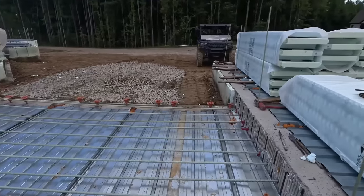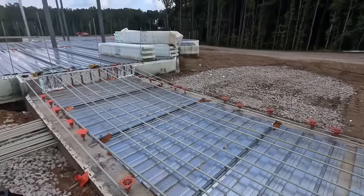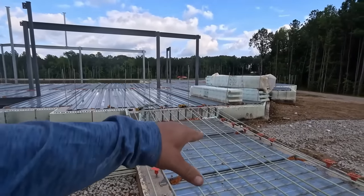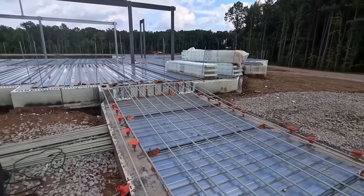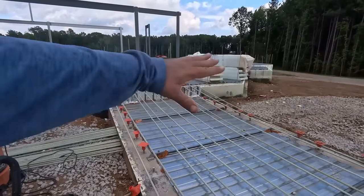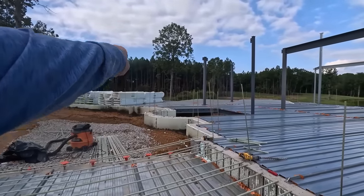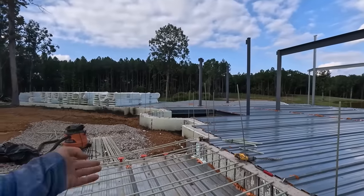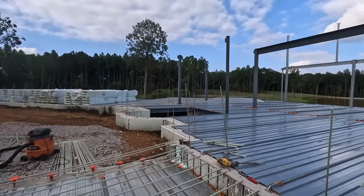All right, so one side is drilled and epoxied in. We're going to let that set up, then we'll drill all those, epoxy those, and bend it just a little bit, which is another thing that's nice about this fiberglass rebar being a little flexible. So we'll pop that in, then we'll have a grid all the way across. We're going to build a platform over that, instead of just trying to do some sort of railing, with nothing really to attach it to right now. So we're going to build a platform over that for safety.